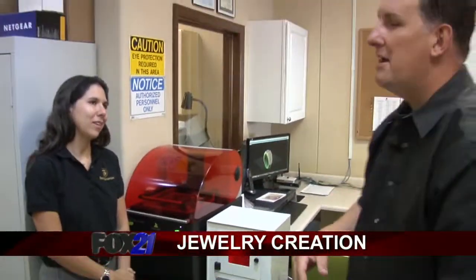When it's done in there, you take it out, then the actual buyer can go over it and make changes. Then you make a mold — we take pretty much like a plaster, pour it around that, put it in the oven overnight. That actually melts away and disappears, and you're left with a negative impression that we pour the metal — gold, silver — into.